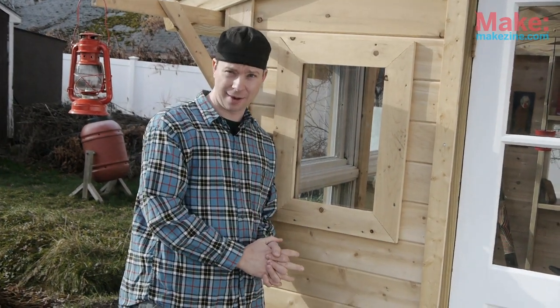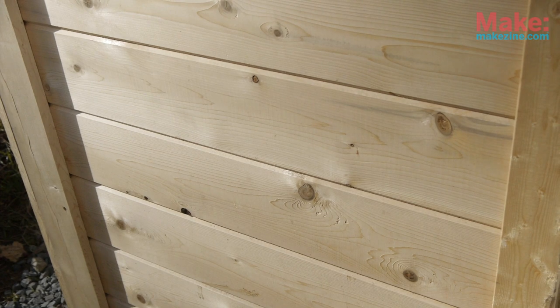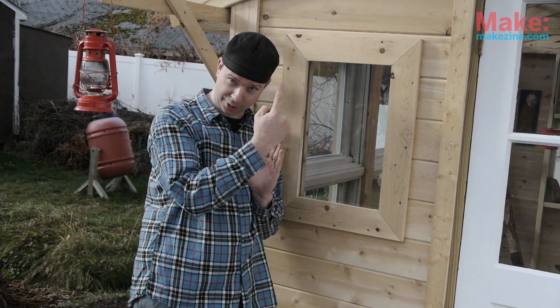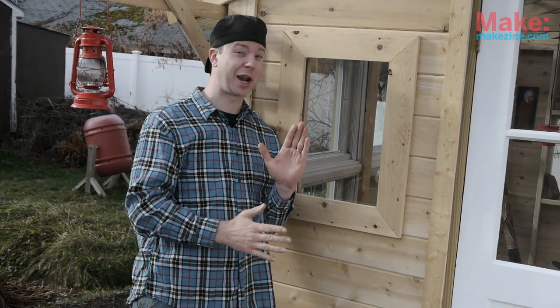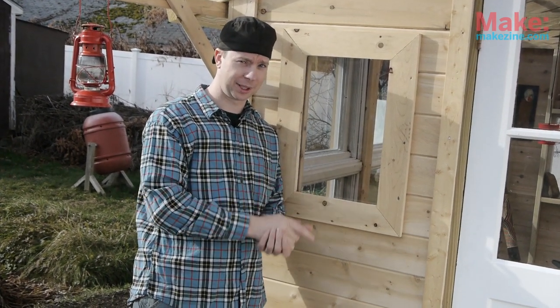This here is poly roofing. You can find it in a wide variety of places, very easy to install. It's held down with hex head screws and neoprene washers, as is the guiding principle on this project. I built this greenhouse to utilize eight-foot stock standard size sheets so we wouldn't have to do any cutting and we wouldn't have any waste. The sheathing here entirely on this cabin is sustainably grown Vermont white cedar. When installing it, always keep in mind with tongue and groove, tongue goes up — so when it rains, you're shedding the rain, not collecting it. We're not trying to build a swimming pool here.